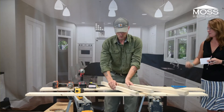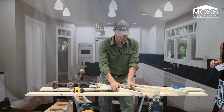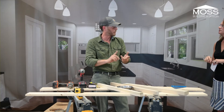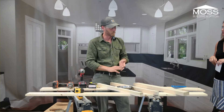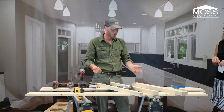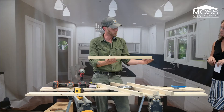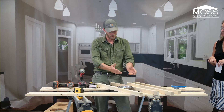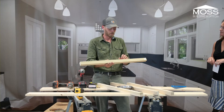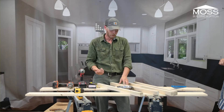Now demonstrating project number two. What kind of wood is this? This is poplar — it is actually a hardwood, but it's one of the softest hardwoods. At Home Depot you can buy oak, poplar, and pine. Poplar and pine are softer and oak is a lot harder. For any purposes at home, the finish color matters — oak stains a certain way, and poplar doesn't take a stain very well, but it's very stable. These two-by-twos will stay straight and not bend or warp. This is a perfect wood for the cat feeding station or small dog, 15 to 25 pounds.